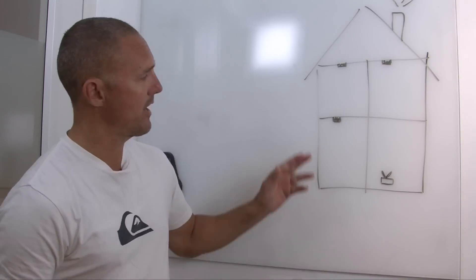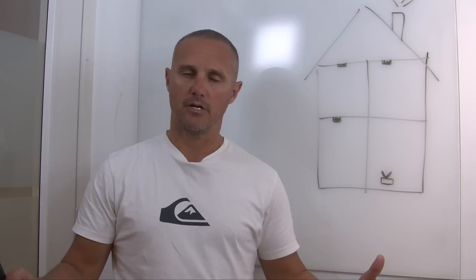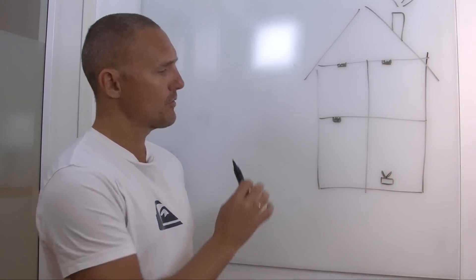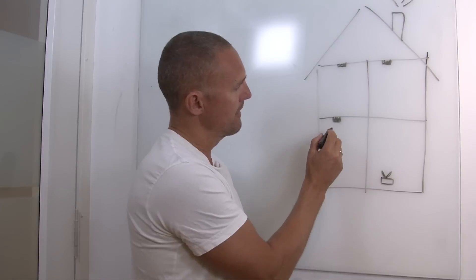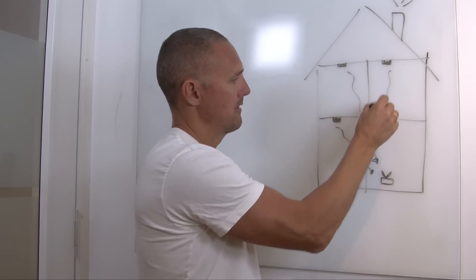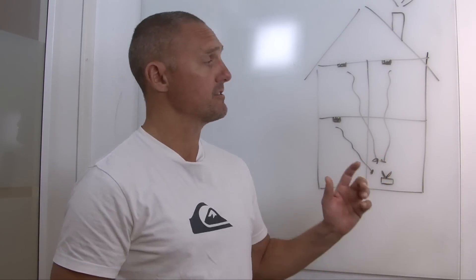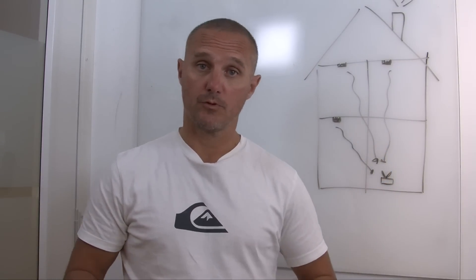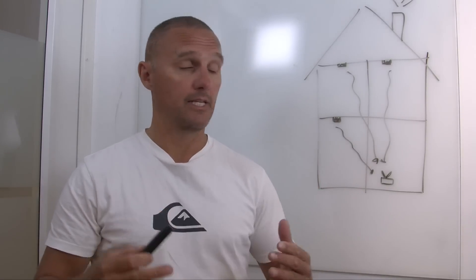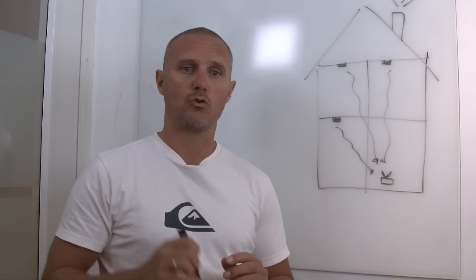Let's consider a house where you have three detectors. These could be any type of detectors like a smoke detector or a CO2 detector. They are connected to a gateway using a simple star network. The link operates at sub-1 GHz, as this gives better indoor coverage compared to 2.4 GHz due to less attenuation through walls and ceilings, and also because sub-1 GHz is better at bending corners.